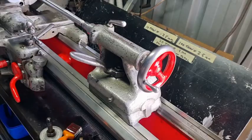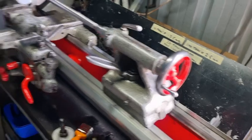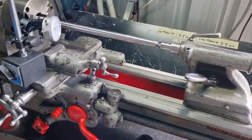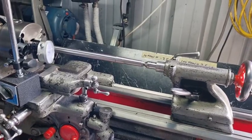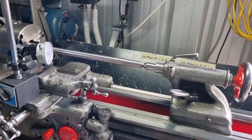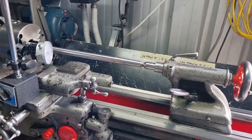That means if I was turning something this length, I'm not going to get a big variation — I'd be lucky if I was a thou out. On a modern lathe you may get better than that, but considering this machine is 72 years old, that's not a bad result. I'm pretty happy with that. We'll now set it up to measure vertically.